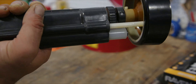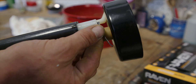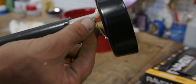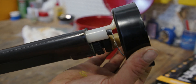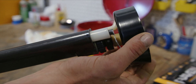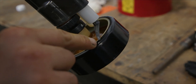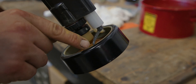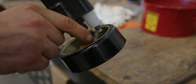For the brush, rotate the gun over. The brush does not make contact with the bell when all the way in. Pull out slightly, push in. Test by rotating the bell to make sure it doesn't lose contact during rotation. The bell and the brush should be making contact on the black conductive surface, not on the white non-conductive surface.